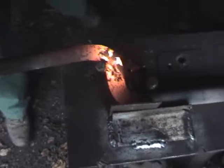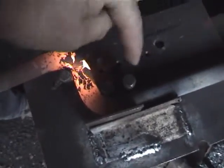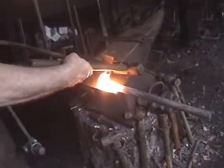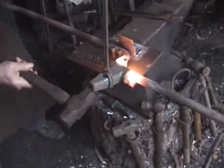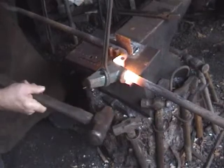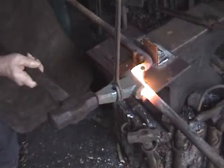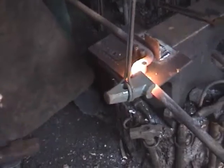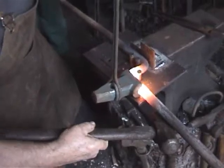I don't want to go any further. So this is where the main bearing will be, and when it's bent the other way, this will be where the large end goes. We need to do a bit of fine adjusting — at the moment the stroke's too much so Rod's bringing it back. What's the tool called? Swage.